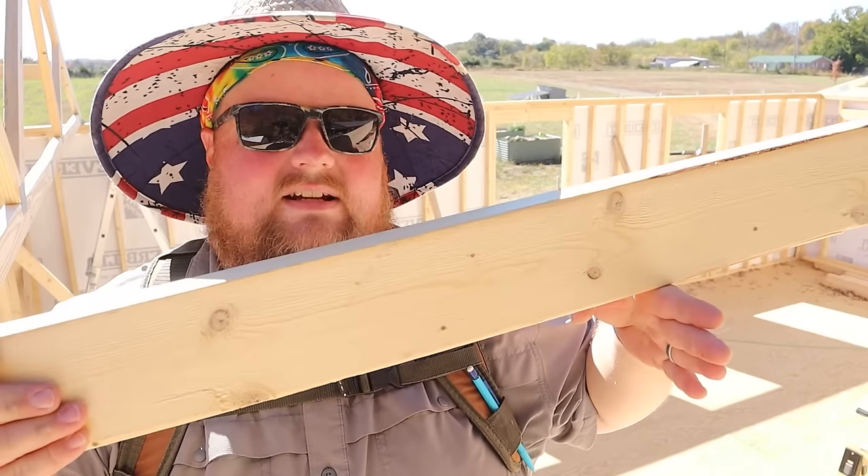This truss is not very easy to put in place, but it is here. I'll no doubt get better as I go along and learn more tricks. The next thing to do is lock it in place, hook it to this gable truss, and make sure everything is plumb, square, and spaced correctly. I have a two by four cut to the exact length I need. This is going to overhang and go over my gable truss. Since I have drop trusses, they are lower — this is designed to sit over it, and then I build out my eave on the end.